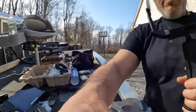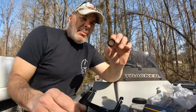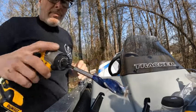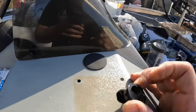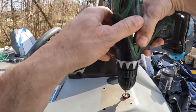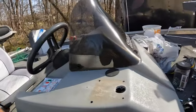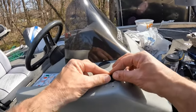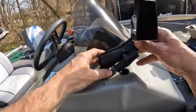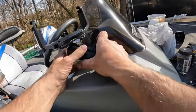So we got this bracket attached, and now we're going to put that over here and see where it fits best. Yeah, that would be good. You have to cut a hole about this size — I think we have a hole saw we could use. We actually need to go a size bigger, which could be a problem. What I've done here is hooked a Dremel head to a drill — we just want to open this up a little bit and I think this will do the trick. I didn't want to go too crazy. It's perfect. Next up is mounting this bracket.